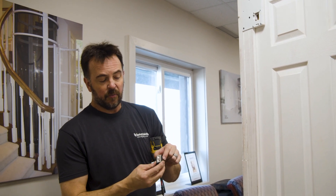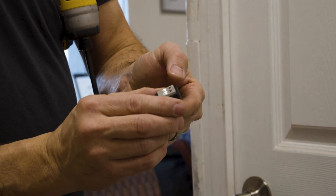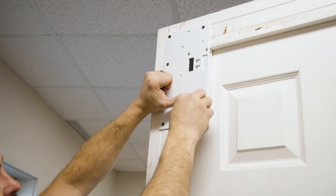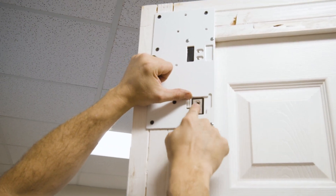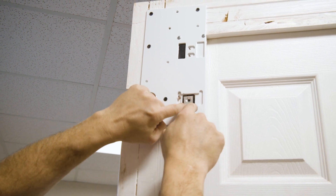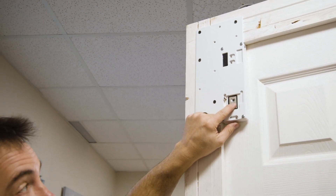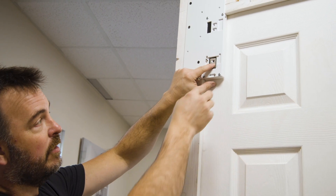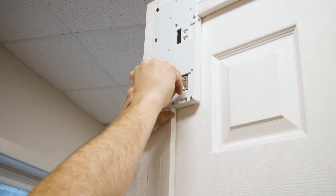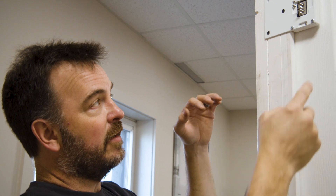The keeper is going to come with a plastic piece around it — a spacer — that is used just for installation purposes. What you do is slide it into the interlock so that it's in the right position, and that spacer will keep it centered within the hole. I recommend that you use a drill to drill a pilot hole. I already have the holes drilled out, so I'm going to just insert the screws, but you would typically drill a pilot hole and then insert your screws.